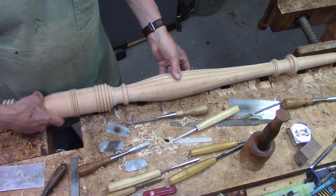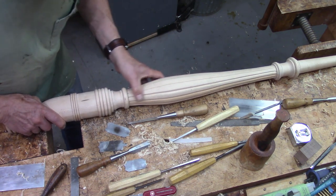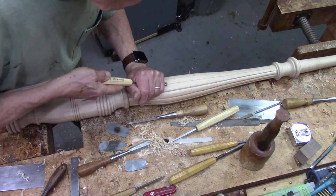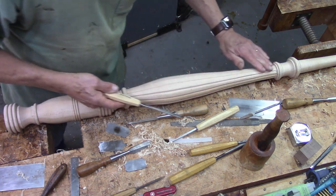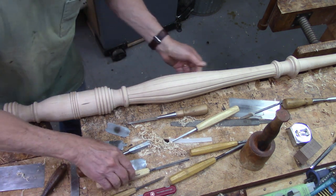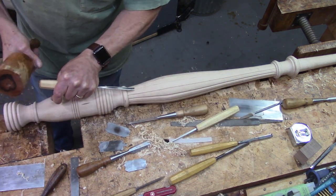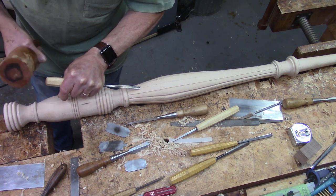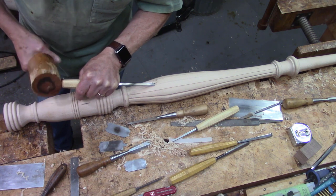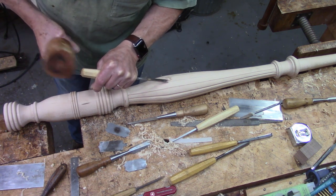The next step is to use a v-tool — a carving v-tool — and go over the pencil line with the v-tool and get a groove. I just set up the pencil line in the middle there, and sometimes I find it easier to just tap with the v-tool. A little bit better control this way. This is hard rock maple, so it's a little bit harder to push by hand. And this works quite well.